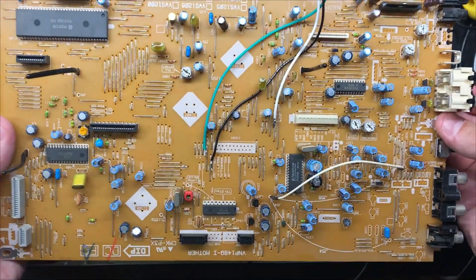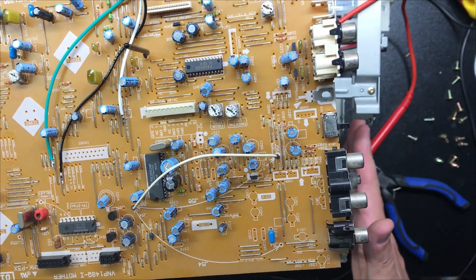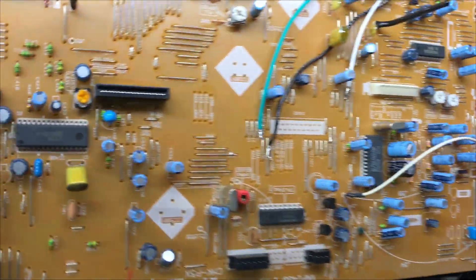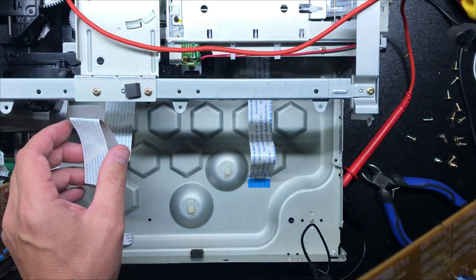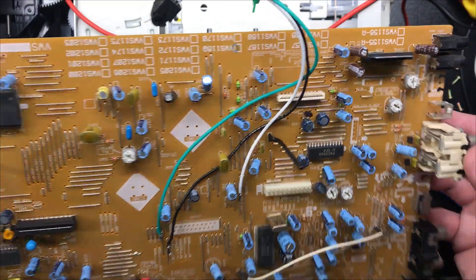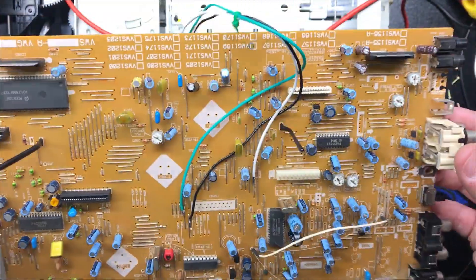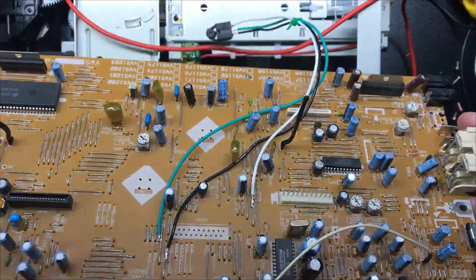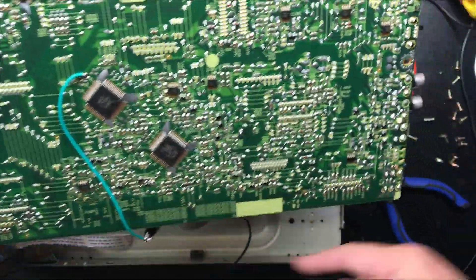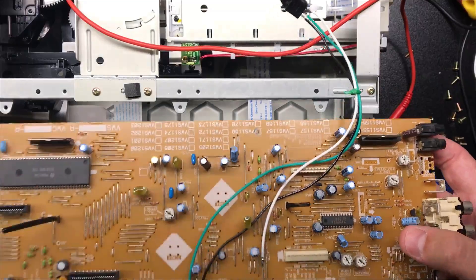So I take back that this is an easy mod. To get this board out, you have to take the back panel out — half of the back panel — and you have to take the video board out right here. But the ribbon cables are all super easy to detach. So I'm adding this as an addendum: you do have to remove this board and solder a lead on pin 43.